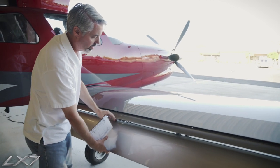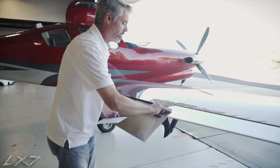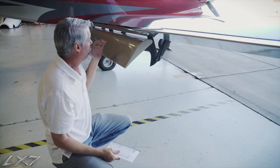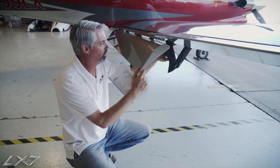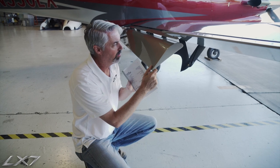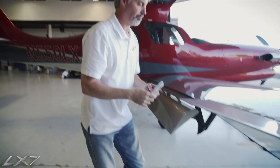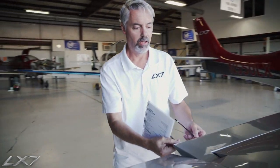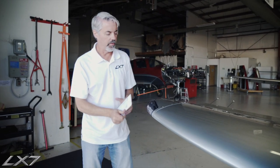The main flap is attached to its hinges as well, and then here we can see the entire drive system of the aileron. When the flap is down, that's one of the nice things about this design — it opens up the entire trailing edge to visible inspection when the flap system is deployed. So we can check all of the connections of the aileron system, verify that all the hinge hardware is intact, and the static dischargers are present.